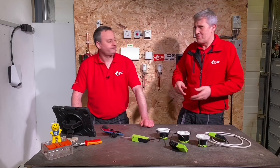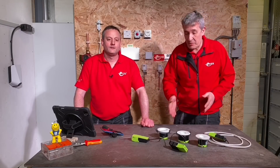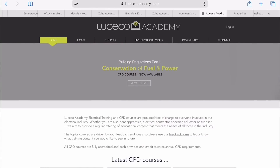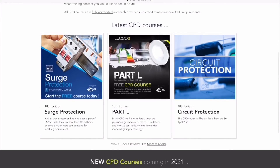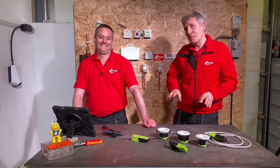The room now has a completely different atmosphere — perfect for relaxing in the evening. When we first showed dim to warm in lamps, some people questioned whether it was a desirable effect, but trust me, if you haven't tried it, it completely changes the ambience of a room. The wattage in the range is 4 to 6 watts, which is really important when thinking about Part L of the building regulations — a 4 watt fitting actually escapes the requirements of Part L. We've done a CPD on that; there'll be a link in the description, you watch a video, do a few questions, and download your CPD-accredited certificate.